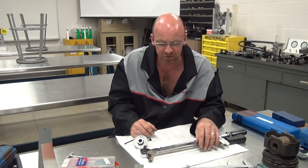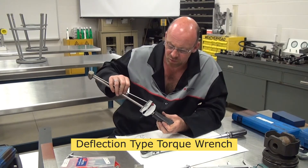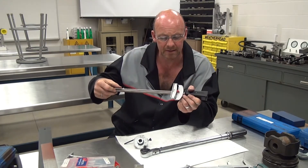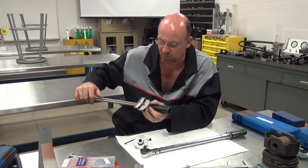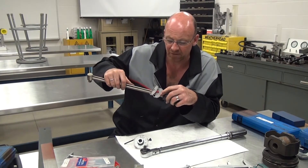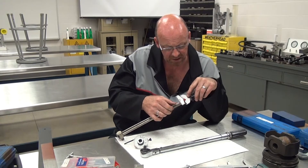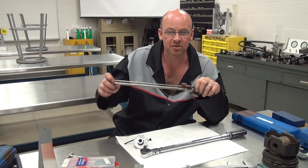There are a bunch of variations on these tools. This tool here is a swing-type gauge — you can see I can just move this, and any time we put torque on here, it just bends the bar while the center anvil indicator stays straight. When the bar bends, it's actually distorting, and we just read the value on the meter face. The nice thing about these is they never really go out of calibration — all you need to do prior to starting is bend that indicator to zero and you're ready to go.